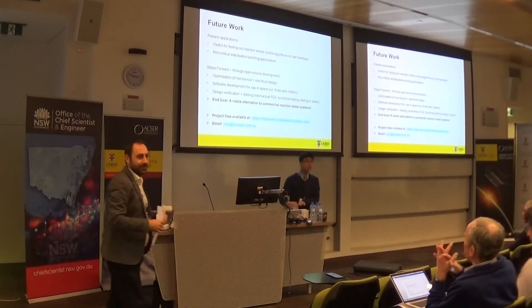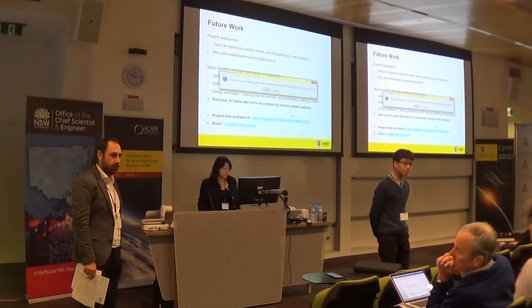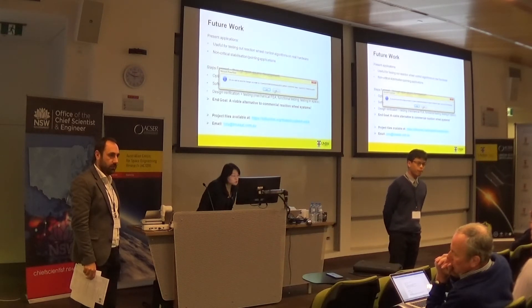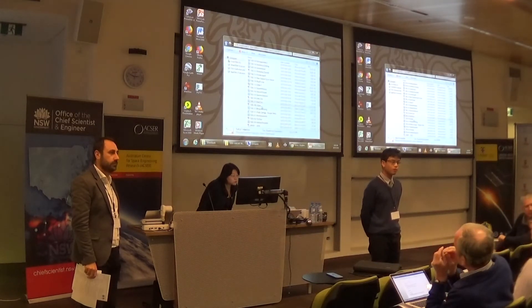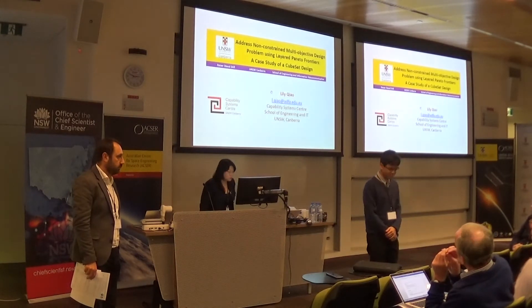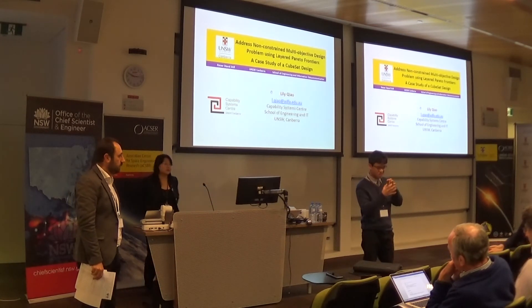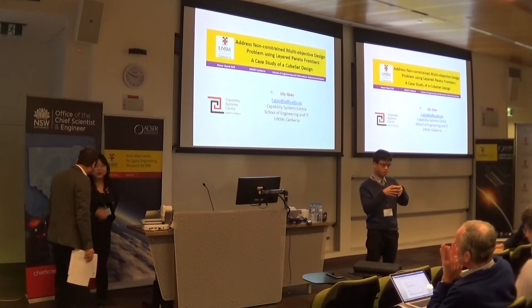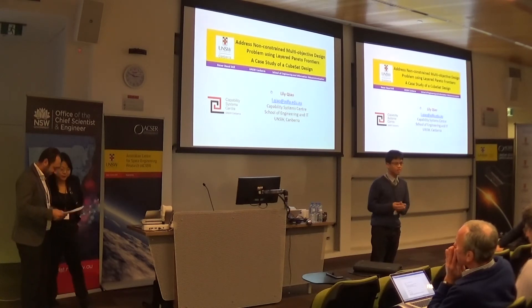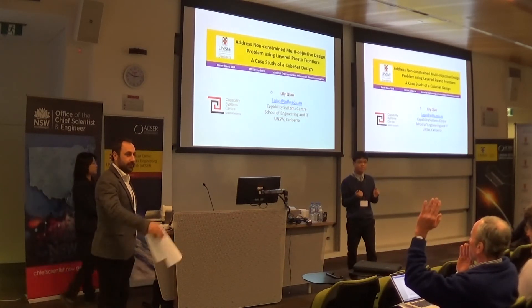So we have time for questions. Reaction wheels are encapsulated because if you have lubricants in the reaction wheel and put that in a vacuum, you're in trouble — it's about keeping the lubricant contained. Companies like Rockwell Collins have reaction wheels in a vacuum that are encapsulated so the lubricants can't escape. There are some reaction wheel units which are partially encapsulated for mechanical strength or protection. They likely use graphite powder or vacuum-rated lubricant.